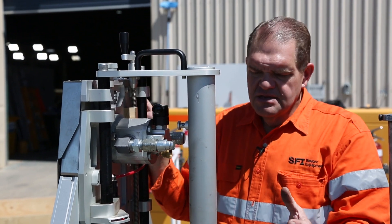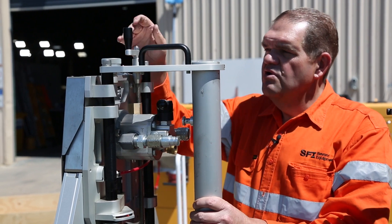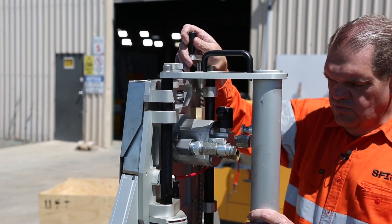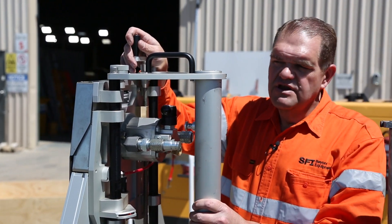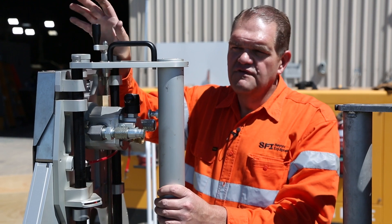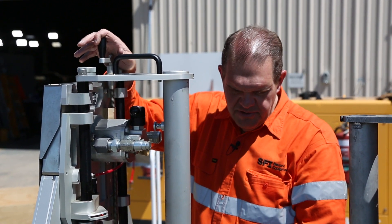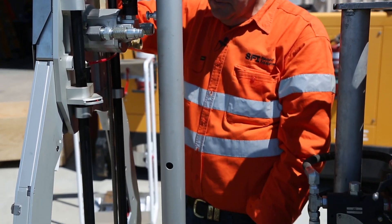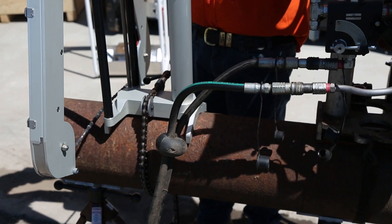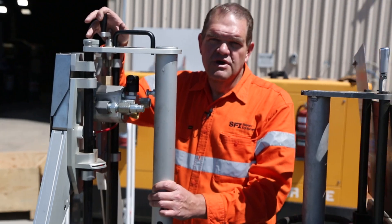As I said, it's clamped to the pipe — it can't jump off and get you or jam and cut you. All you've got to do is wind this handle down and take the front of the saw down as the wire goes through the pipe. So very safe, very simple to operate, and very quick. This particular pipe we're actually strapped to — a bit of ductile cement lined here — it would probably take around about three minutes or less to actually cut. So it's a pretty quick method.